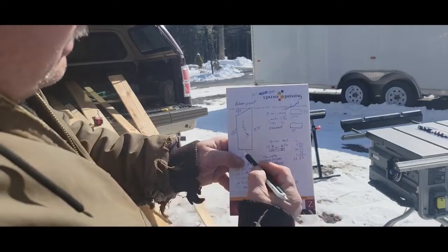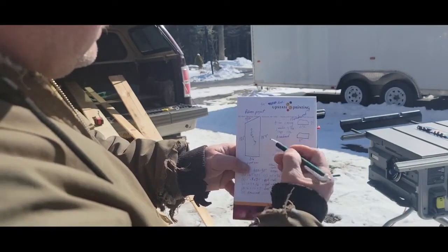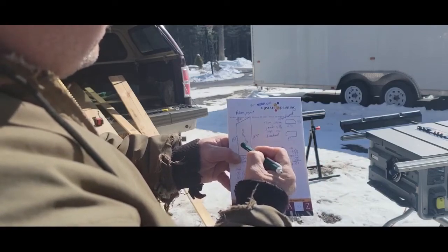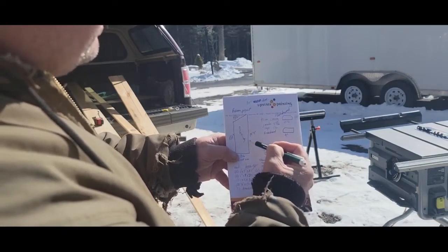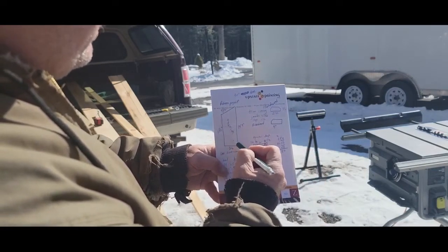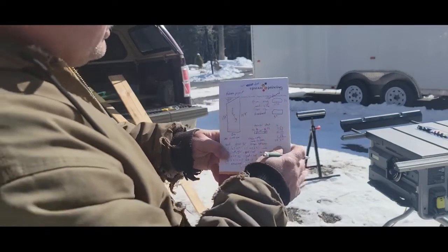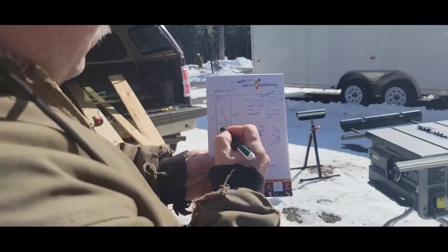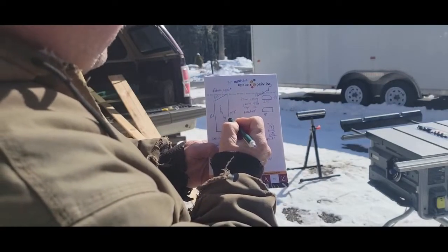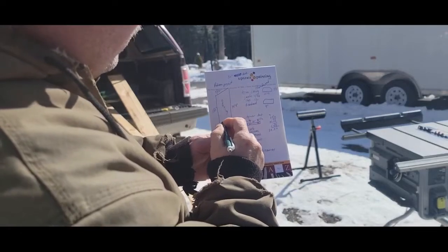What I've got is, this is the 36-inch width opening. It's exactly 36 drywall to drywall. That little closet that we saw was up in this area. This height is 13.5. This height is 14.4. And I want to put a 30-inch door in there, and it'll match the bathroom door, everything right there. I think almost all the doors are 30s. Wish they were larger, but this opening is only 36, and so I need to put a 2x4 frame, possibly two on one side, and a 3/4 inch jamb.